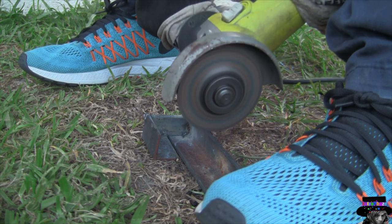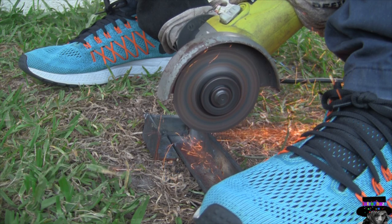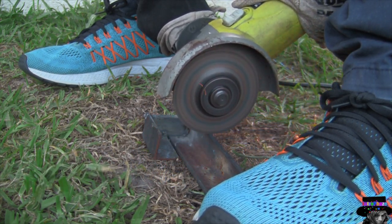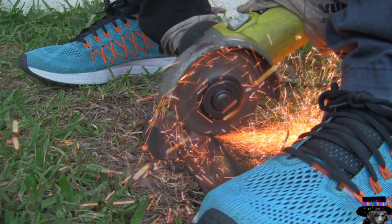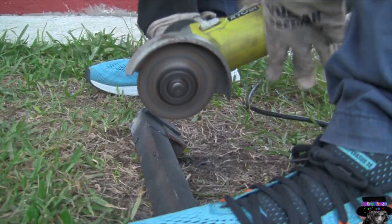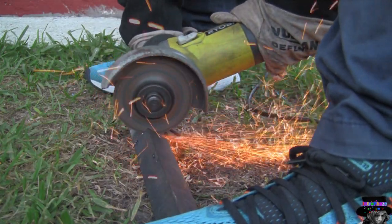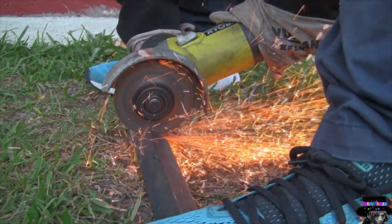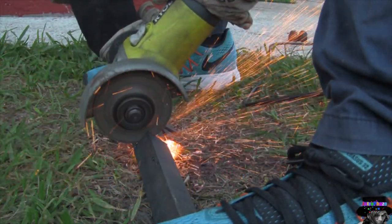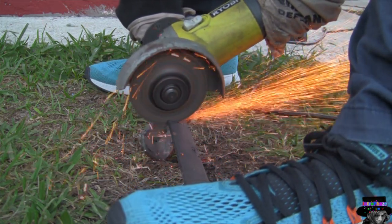This is made of steel, but you can actually do all of this with JB Weld and aluminum and it'll work exactly the same. So instead of welding, you'd just be gluing it with JB Weld. Steel is kind of heavy, so another way to do this is with little bolts and nuts and a drill — and if you're going to do that, use aluminum, it's way easier to drill through. For this project I'm just going to use a welding machine.